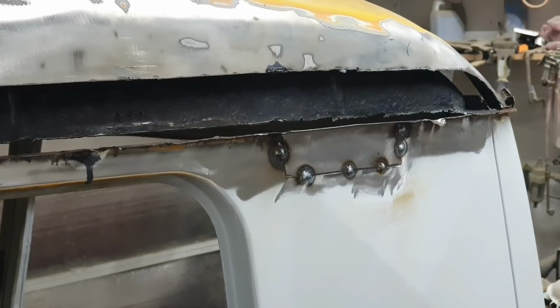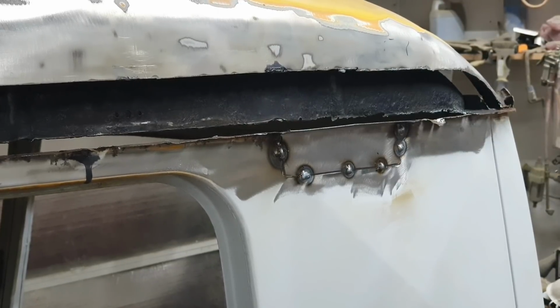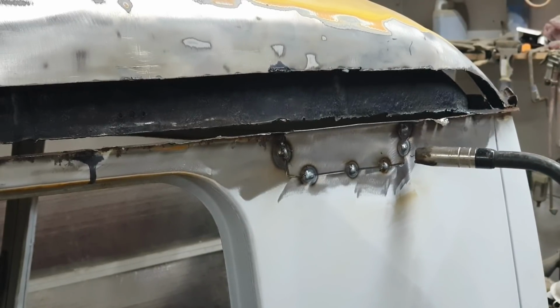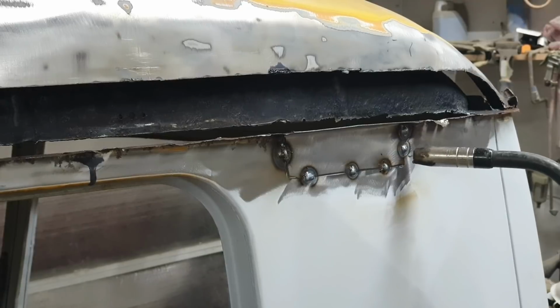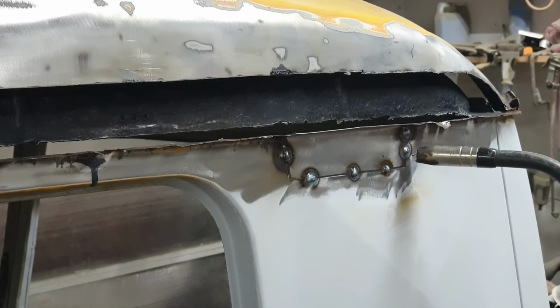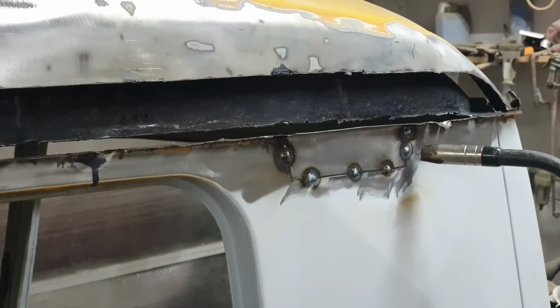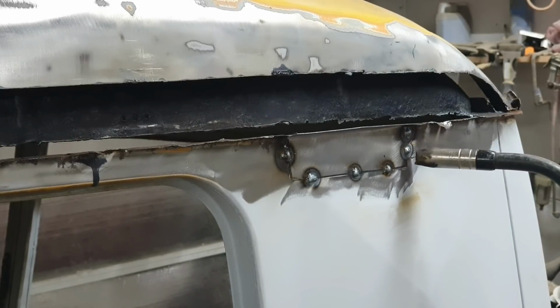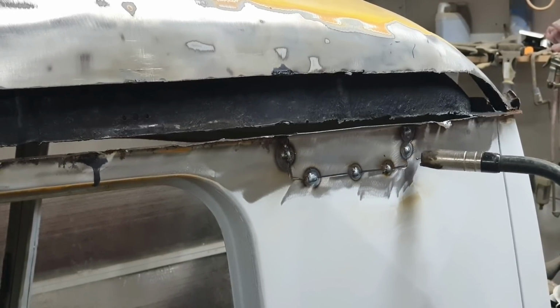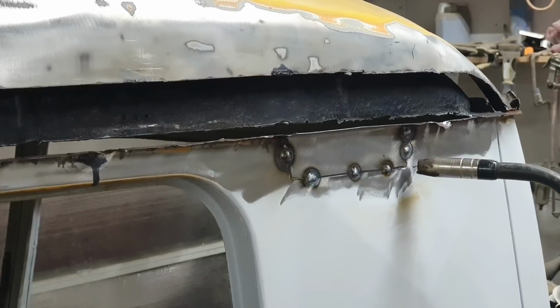So it was a little different then. But what I'm going to do myself, to save some time, is a little bit more than a spot weld. If you're a little bit better at it, you can do that too. I'm going to go about 1/4 of an inch, okay? And then I stop. Because if I go any more than 1/4 of an inch, I'll start burning through.